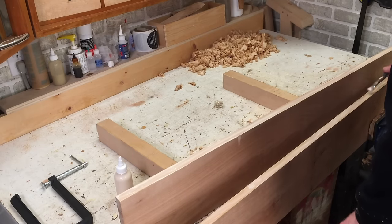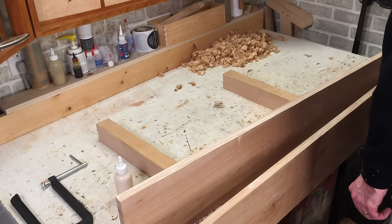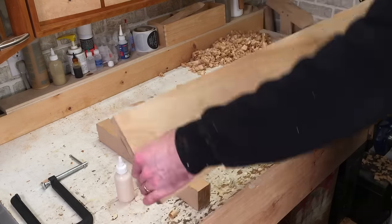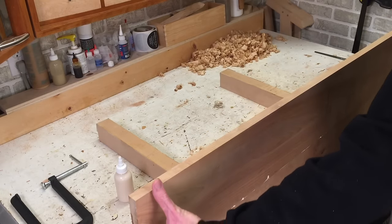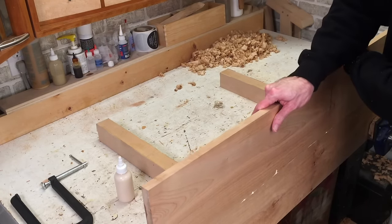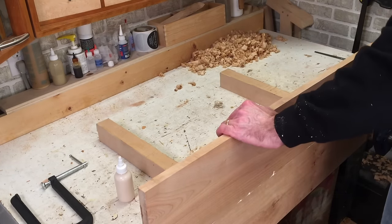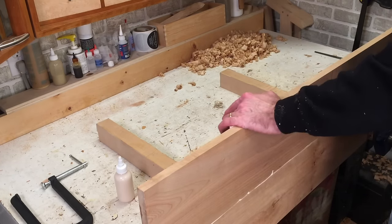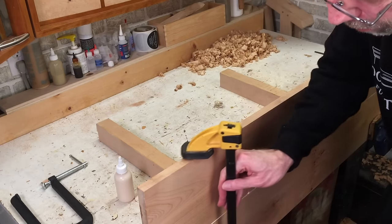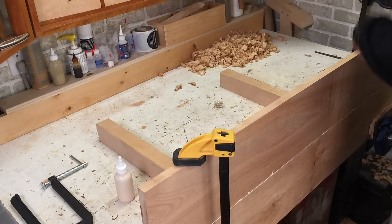Okay, and then the next step is I'm going to lay this down, one board on top of the other, and then clamp it together. Like this. Now, it does become slippery as you do this, and if you just slide it back and forth, it actually helps, again, spread some of that glue. So I'm just going to temporarily put one clamp here, another clamp down on this end,